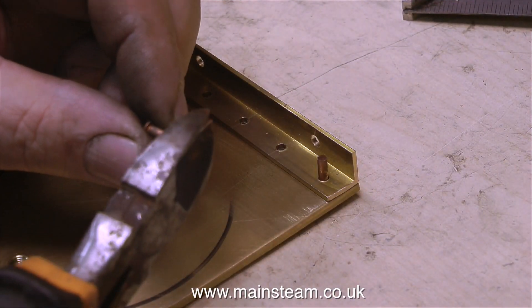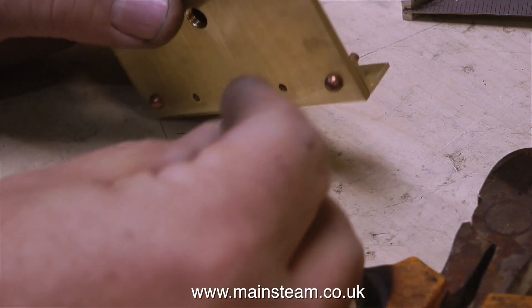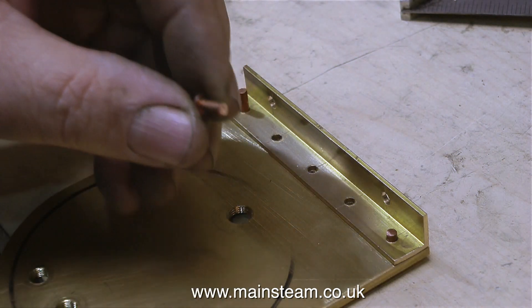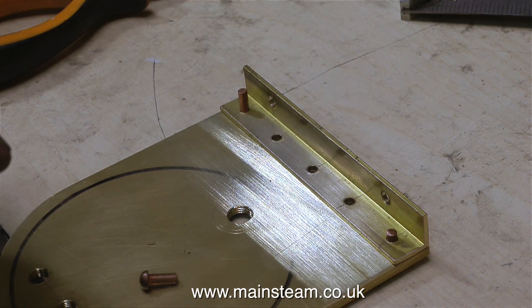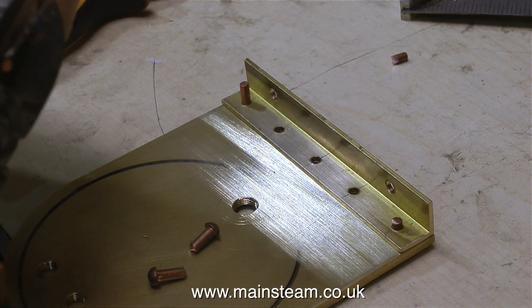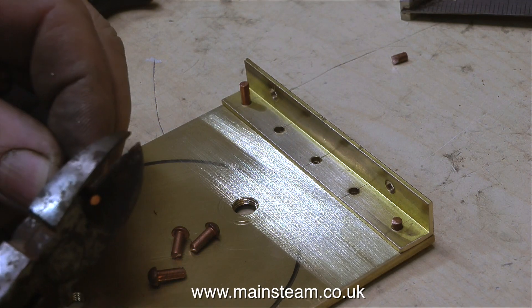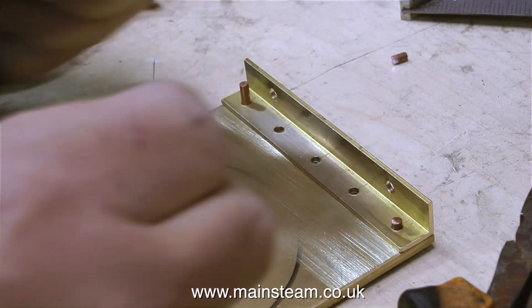And now it's riveting time — try and contain your excitement for this bit. I have to chop the rivets because the ones I have are far too long. The problem is that once I chop the rivets with the side cutters, the distortion at the end caused by the side cutters means it will not go through the hole. So I just clean them up on the one inch belt sander. What I should do is make a jig, push the rivets through a hole and chop them off clean with a chisel, but I've never really got round to doing that. I'm cutting five rivets with the side cutters and after cleaning up the distorted ends on the belt sander, I'm ready to start the riveting process.